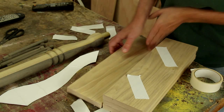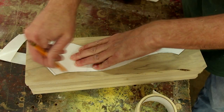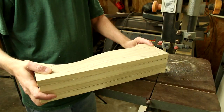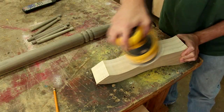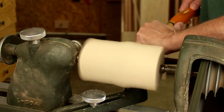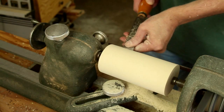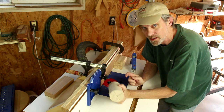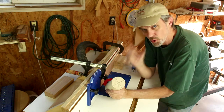I'm sticking together these four boards with carpet tape and I'm going to cut all the legs out of them. Even though I only need three legs, I'm cutting an extra one just in case I screw up. I've also glued up a larger blank that I'm going to turn as a base for the legs. I spent a long time today trying to figure out how I'm going to cut the slots for the dovetails in this round piece, and I thought of a lot of different jigs, but I only need three short little slots.